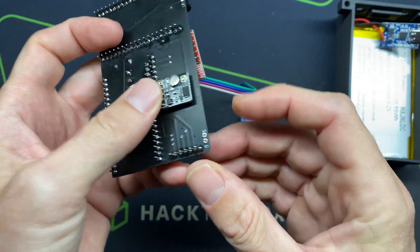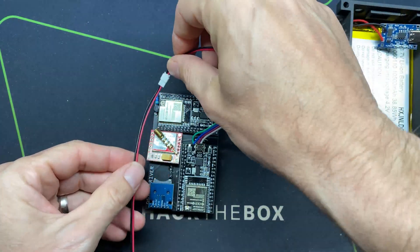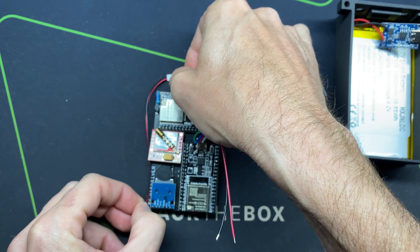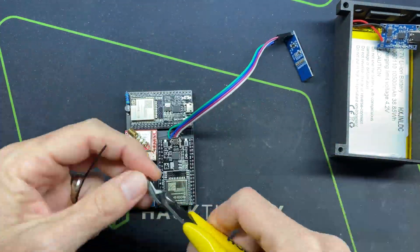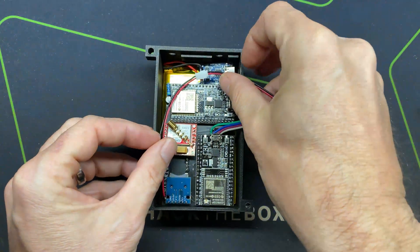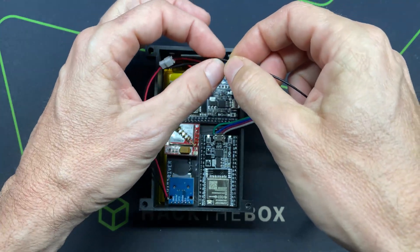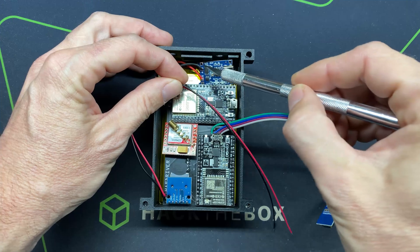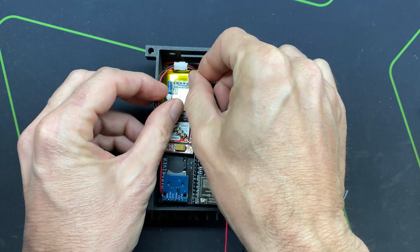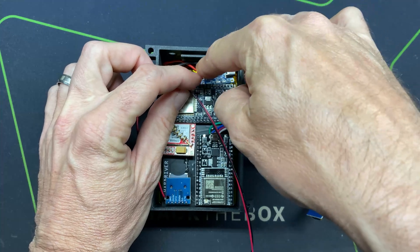On the bottom of the board there's a 5V pin where the red wire is going to go, and black goes to G. We're going to bring the wires in from the top and solder them on the bottom. For that I'm going to use the JST plug — I want that plug to land up at the top of the board. I'll measure, cut, strip, and solder them in. Now with everything test-fitted, I'll take the negative side of the JST plug and solder it onto the out-minus port on the charging circuit, driving it through the top and soldering on the bottom.